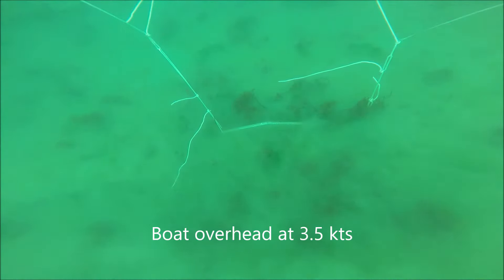We are in my standard sandy mud testing location in 26 feet of water with 3.5 to 1 scope, boat backing down about 2 knots. The anchor laid over on its side initially but immediately digs in. Then I drive the boat up and over the anchor at 3.5 knots — it's a rather violent simulation of a wind or current reversal.